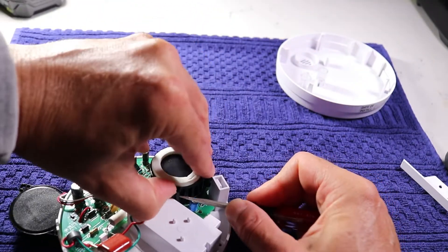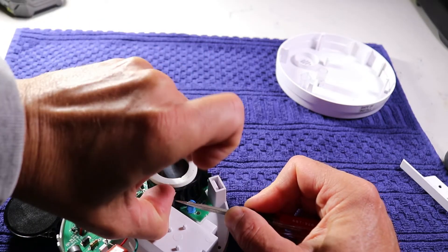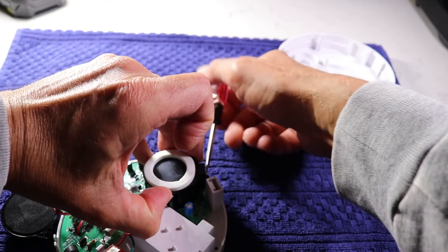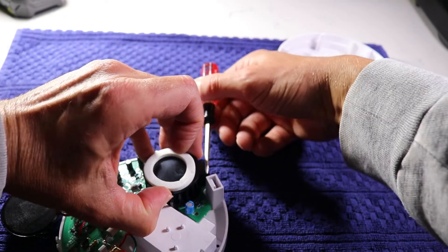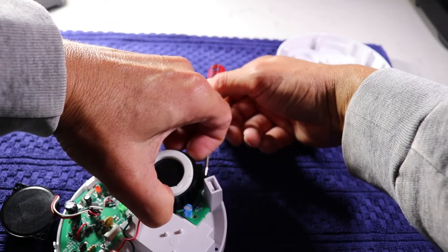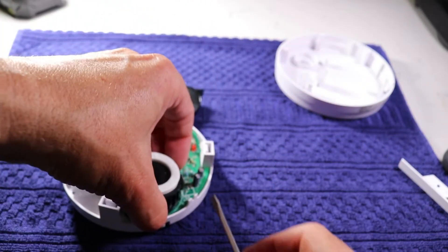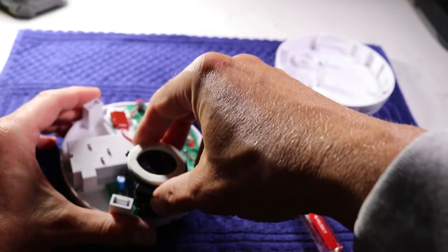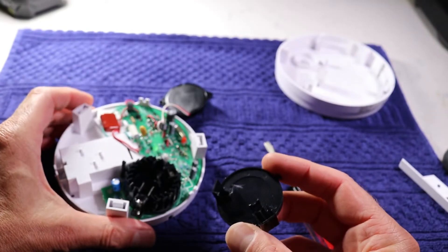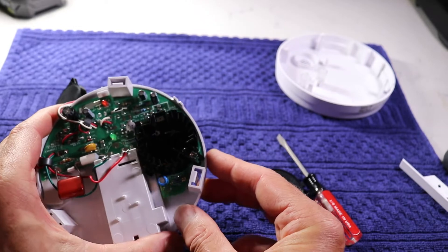The photoelectric unit comes apart in two pieces. The top will actually separate from the bottom and there are three little clips of different sizes that ring around the unit. You'll have to pry each one open and then lift the top up. It's totally a fiddly operation so be patient so you don't break anything. After having said that, of course, I make it look easy here — but I actually re-recorded this segment a few times just so I wouldn't look like a dummy.